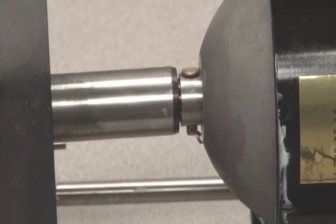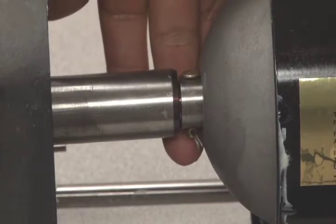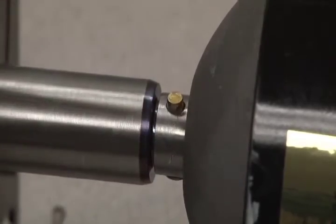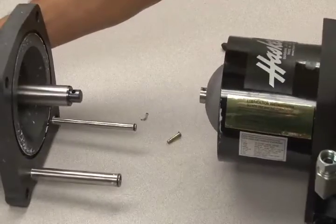In order to separate the rod from the piston, you will need to first remove the piston cotter pin. To remove the cotter pin, bend the legs straight so they'll fit through the hole. Next, pull on the loop to extract the cotter pin. After removing the cotter pin, you can pull apart the plunger from the piston.